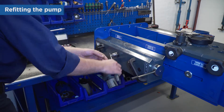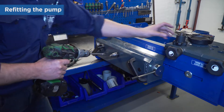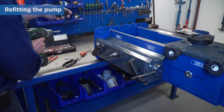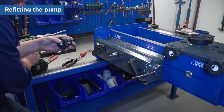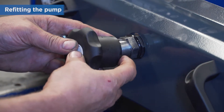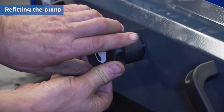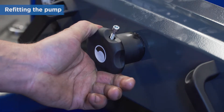Start by tightening the release. Choose the proper spring hole inside the black knob that will align the knob screw with the hole in the release. Engage the other end of the spring and turn the knob with the spring half a turn before pushing and tightening the knob screw through the release.